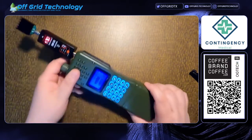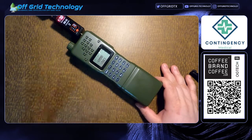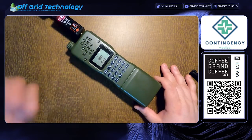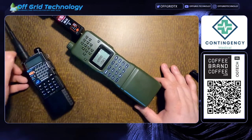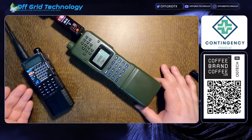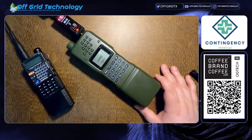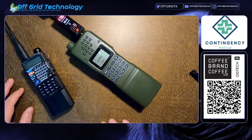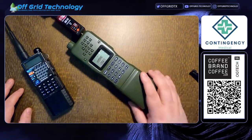So you've got a UV-5R with a 12 amp hour battery — four times a normal UV-5R battery — putting out 7 watts on both VHF and UHF. You can get the BF8HP which does about the same, close to 7 or 8 watts. But a normal UV-5R, RD-5R, or similar platforms are typically about 4 watts on UHF and 5 watts on VHF. You're getting 7 watts on both UHF and VHF out of this radio.